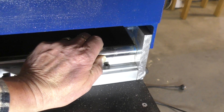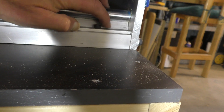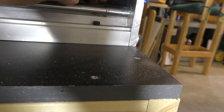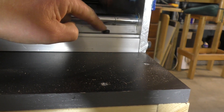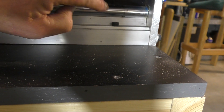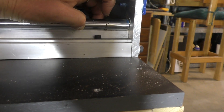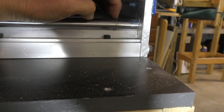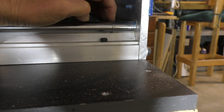If you don't feel confident cutting through it — and it's not a good idea to cut aluminium with a slitting saw because it just gums up — when you dismantle this, it's screwed through using cap screws into the metal. Remove the aluminium part and cut them separately. Using the slitting saw you can cut the steel shaft to exactly the length you require.